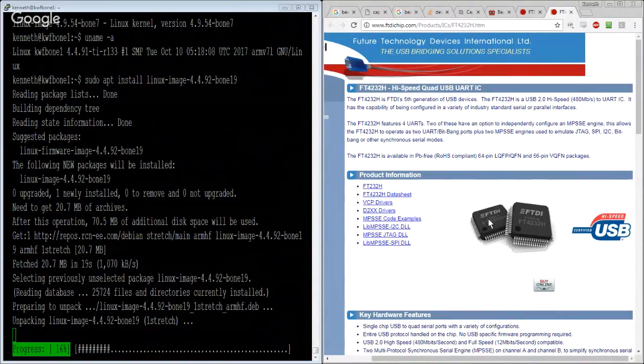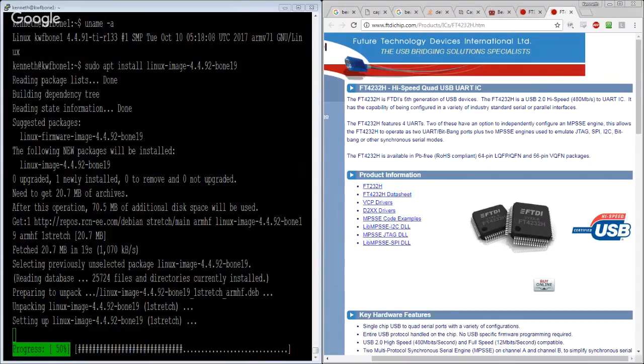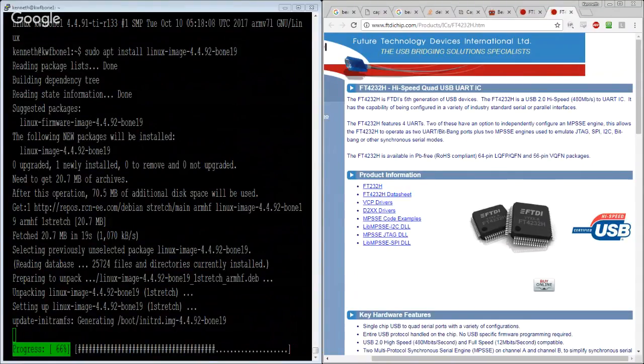This chip is a 4-port UART, right? And so we could pretty much just build a purpose-built USB serial adapter that has 4 UARTs, 4 RS-232 translators, and 4 RJ45 or 8P8C connectors on it, and set everything up exactly how we want it, except we're no longer tied to the BeagleBone, and we can drop this into whatever piece of hardware we want. So I think I'm gonna give this BeagleBone about another 10 minutes before we jump ship and start working on other solutions here.